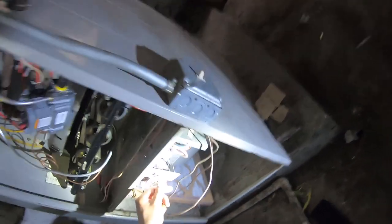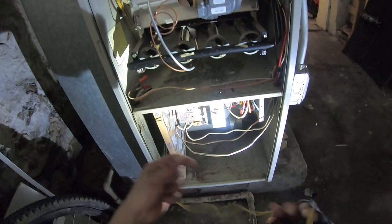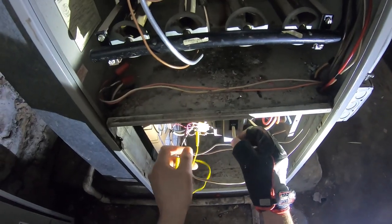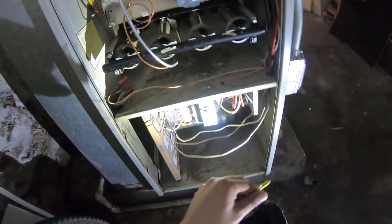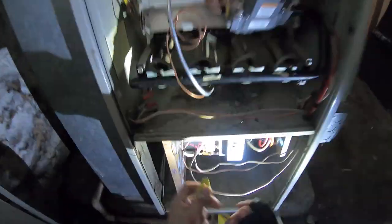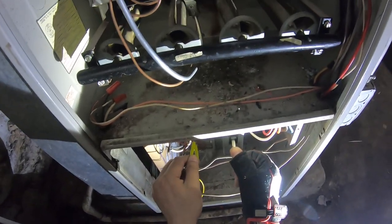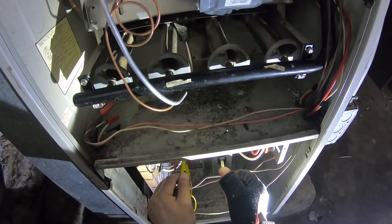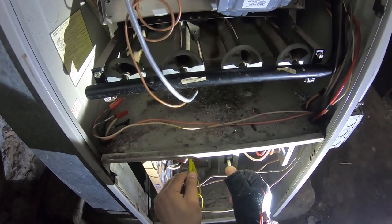And this, the switch, they wired it out. Oh, okay. Tell me if the outside unit turns on. I'm gonna just jump it directly and see what happens. You ready? Yeah. Did it turn on? It clicked, but the fan doesn't turn. It clicked? Yeah, now it clicked it in.